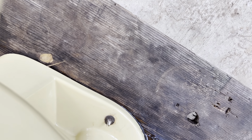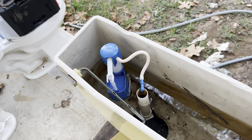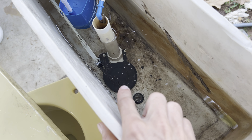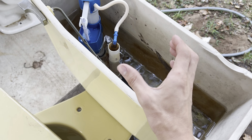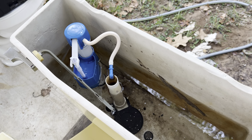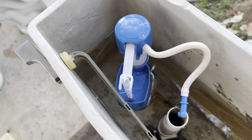There was a seat on here but it was not yellow — it was just one of those cheap MDF wooden seats that was all destroyed. The only things this toilet came with when I got it were the handle and the flush valve. It had a flapper as well, but it was shrunken up from sitting out in the heat so much and would not hold water, so I replaced the flapper and put in a new fill valve because it fills kind of fast. The date stamp says April 22nd of 1978.